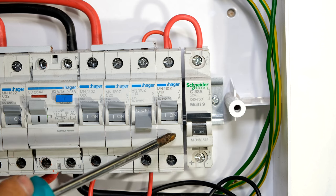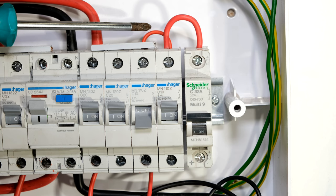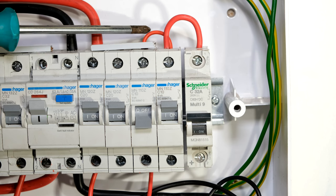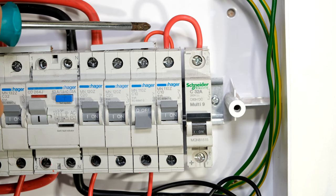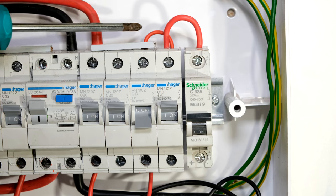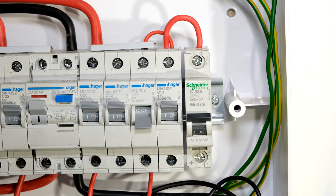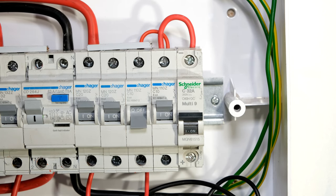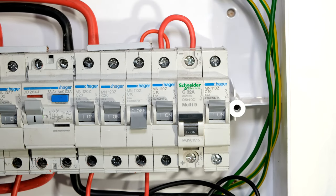Now if we look at that, 25 amps would have to flow through that wire over there, and that's where it becomes a problem — because this wire is not designed for such a high current draw. What would happen is the PVC would start to burn and you'd now have a fire hazard. And what makes it even worse is someone may come and add yet another circuit with another jumper.